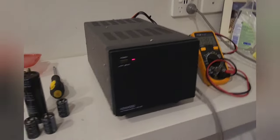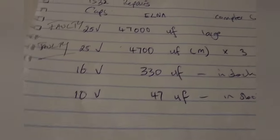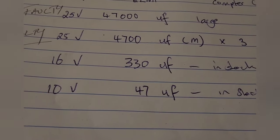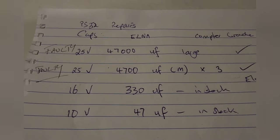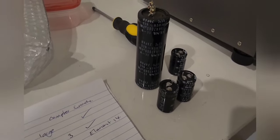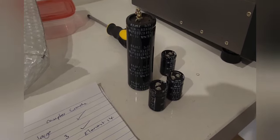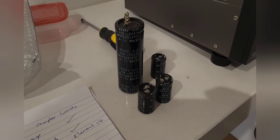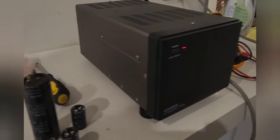That's your lot for today. These go in the bin — they were the two capacitors I didn't have to replace: the 330µF and 4,700µF, which tested fine. It was just the 47,000µF large one that was faulty. The replacement is a much better product, sourced from Element 14 — quite good, shipped here in about four days.